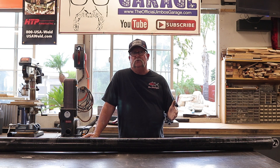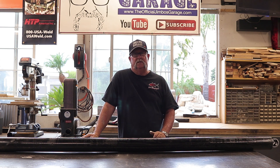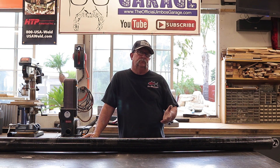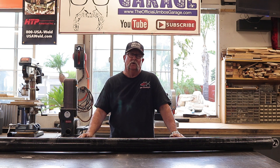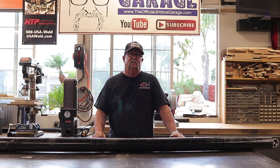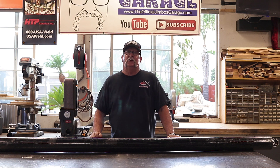What I want to do differently with this one is the welding process. Typically on something like this I would be stick welding, probably a three-pass method. That's what I've done in the past. But I'm going to try something that's relatively new to me — dual shield flux core. I've recently started using this just a couple of months ago and haven't really had a chance to use it on anything, so I thought this would be a great opportunity. Let's get started on this nice little project.